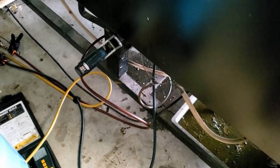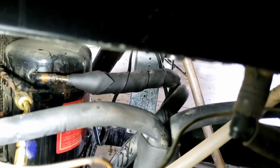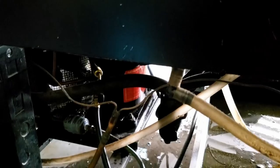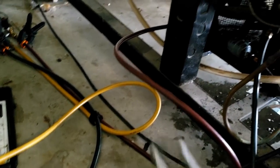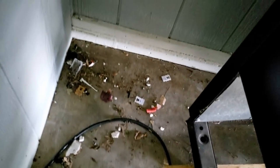Kill it. That dryer is probably more along the lines of what this thing originally had. Got the insulation back on the suction line and on the compressor. Did verify — blew through those lines and made sure they were clean and clear. Let's see if our pressures are pretty much equalized — 76 and 69, looks close enough to me. Let's kick this thing on and see what it does — there it goes.